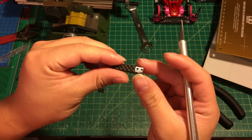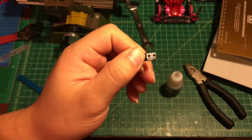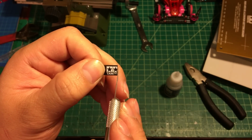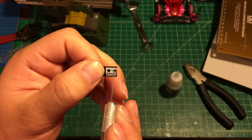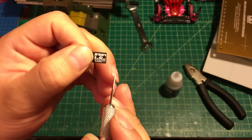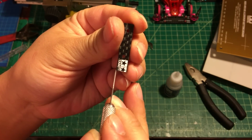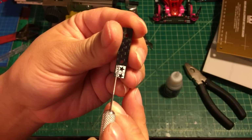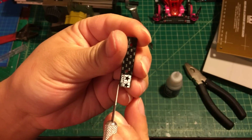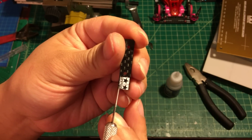Since this piece is 3 millimeters thick right now, what I'm going to do first is, from here, the bottom, to here, make a line which is 3 millimeters high. So from here to here, see the line I just made, this is 3 millimeters high. And for the little edges right here, from this edge to a little bit right here, I'm going to make a line that is 1.5 millimeters. Remember, it's from this side to this line right here. So this distance is 1.5 millimeters.